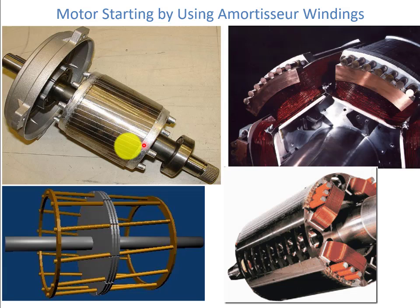This is how it looks, and it is comparable to the cage rotor of an induction motor. It's just like a cage rotor of the induction motor. Here we can see it in the synchronous motor as a salient pole, and also in the non-salient pole form, which looks just like the synchronous induction motor rotor. This is how we can have this cage on the rotor, where underneath we have the winding.